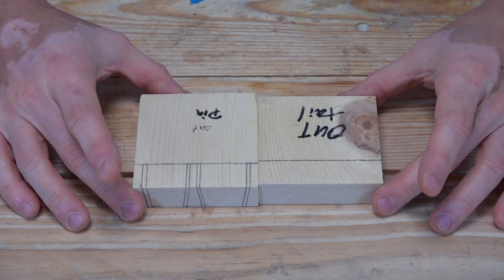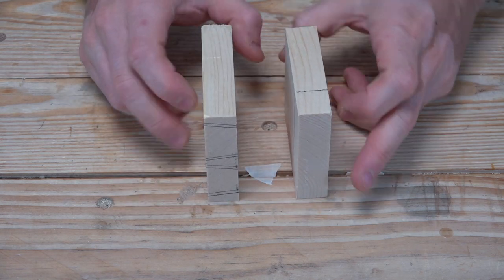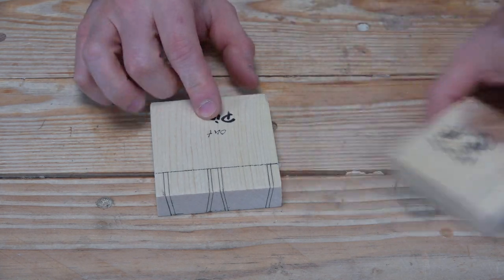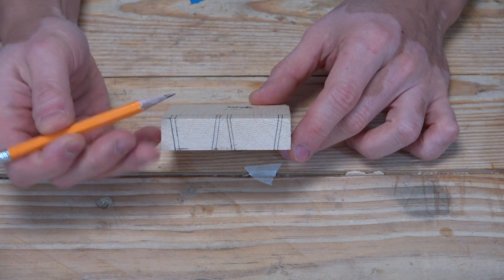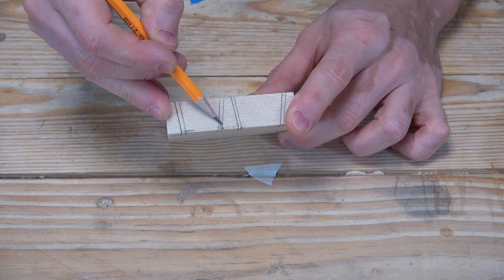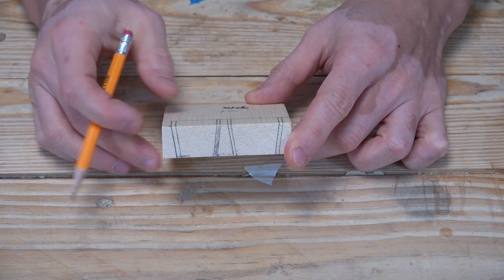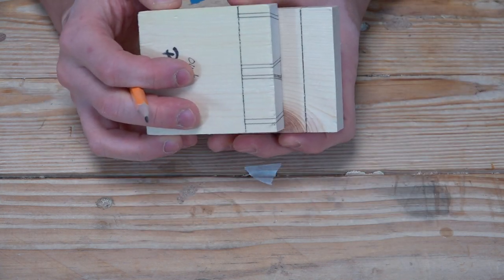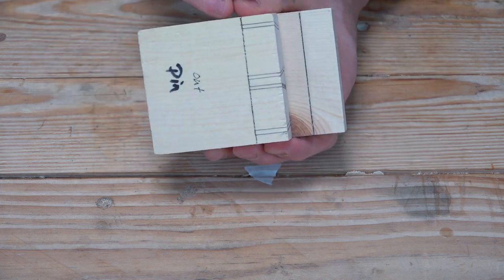So I want to show you how to align the saw. Here's the same marking gauge line that I had made earlier, on both sides. I'll label the outside for the tail side and outside for the pin side. This is the side I cut first. I've used double lines here to show you where the saw kerf is — I'm going to color in this black part. Imagine this is the saw kerf — it's the thickness of these two lines. So lining these out, outside to outside, and lining towards the marking gauge line that I had made.